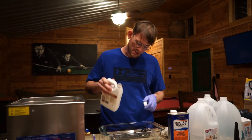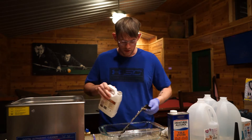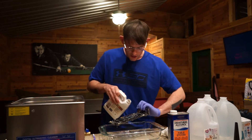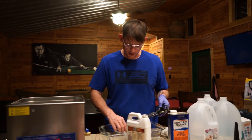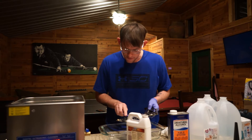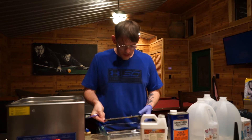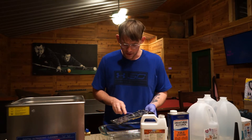What we've got now — I'm just going to take some isopropyl alcohol and run this over the board. You want to do this because alcohol is a displacer, meaning it's going to move water out of the way and help make sure this thing gets dried off the way you want it without any residual stuff on the board. I also have a background in cleaning iPhones, so I'm going to take a little brush to this as well. Honestly I felt like the Windex didn't do too good of a job — it took some of the dust off but it felt a little lackluster to me.